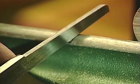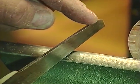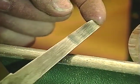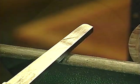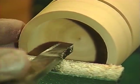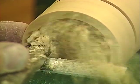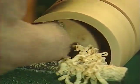I'm now going to show you a modified 3/4 inch scraper. It's been ground down the sidewall, as you can see, about 3 inches. It's got an undercut of about 15 degrees. It's a small radius, and across the end, again, it's a 15 degree undercut. I'm just taking the cuts across the end there and up the sidewall.